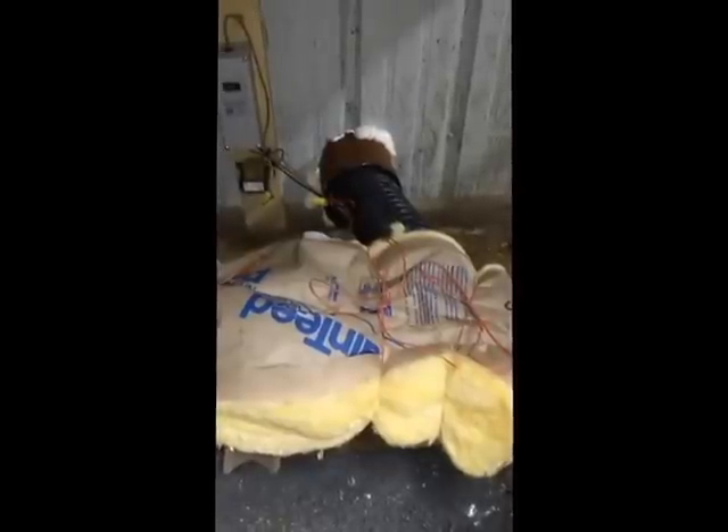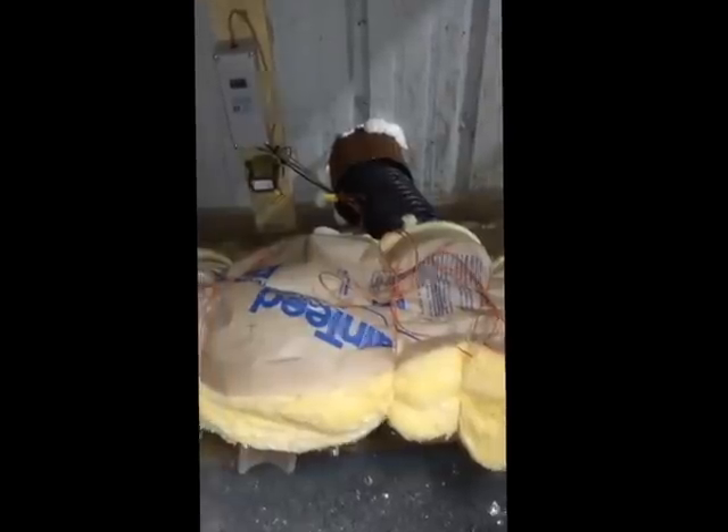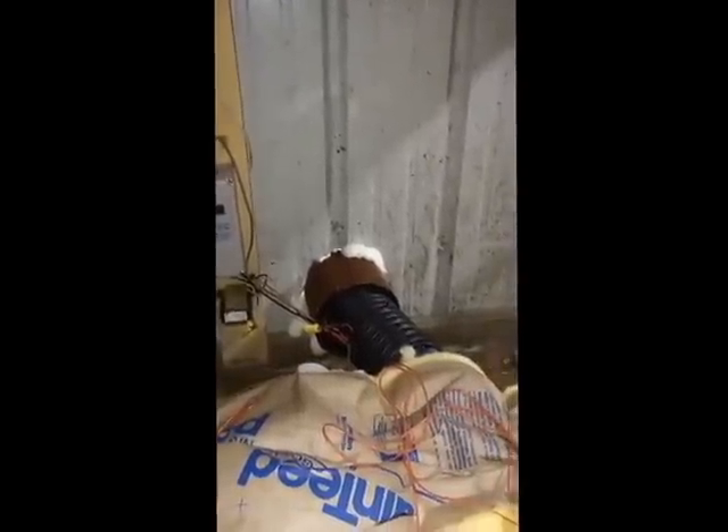Now we're in my garage. I have the boiler hooked up to one of those larger heaters that I have insulated and protected right now because I'm not using it — that's a much larger one than I have on my porch. After the water goes through there, it comes to this unit which is heating my hot tub right now. There's a thermostat that turns on a valve when the hot tub falls below a certain temperature, and a heat exchanger in the hot tub unit draws heat from the boiler water to keep the hot tub warm. I'm hoping this will save $50 a month in electricity, but I just installed it the other day, so we'll find out.